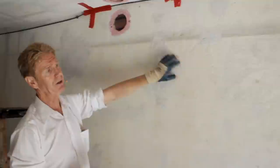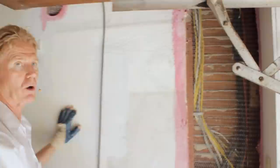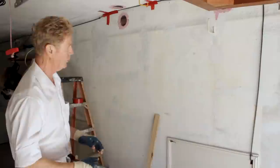I'll show you one more thing while we're talking about mushrooming. Inside here we have wood lath — old wood lath. And you can see the Structolite mushrooming through that old wood lath. That old wood lath was used from 1890 to about 1920. I still see it used in 1930 and 1942 because of inventory.